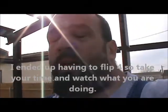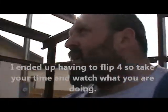So alright guys, I'm gonna get up there and bolt these up so I can get done. I'm about tired of climbing up and down this ladder, man, I'll tell you what. Oh, and I had a couple rafters that were wrong. They're Z-shaped, and one's wide and one's narrow, and I had them wrong, so I had to flip 3 of them, and that sucked. I was kind of in a hurry yesterday, not paying attention, and I had to fix it today. So, all right, gentlemen, I'll turn you back on here in a little bit, maybe after I got these braces in here. And they're right here. So, all right, take it easy.